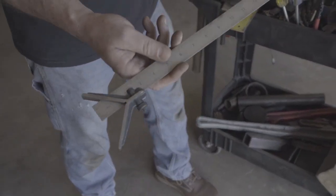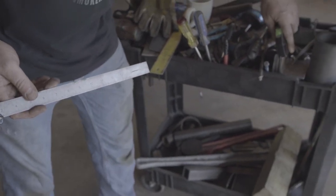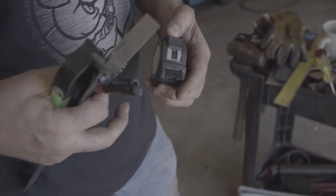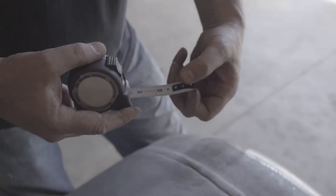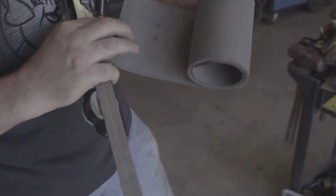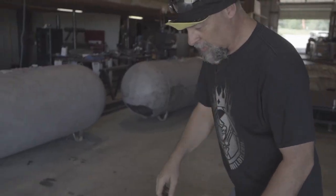Got our center head square - you've seen me talk about that before. And a little torpedo level. We're going to need a marker. I got a really cool floppy tape measure - this thing saves our soul in here when we're marking tanks because it's durable. You can also use a pipe wrap, but it's not big enough. Then one final thing we'll use in a minute is a chalk line. Our tank is level and we're going to do this on both ends, close to the seam.